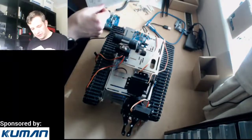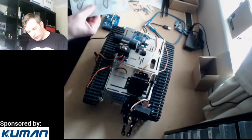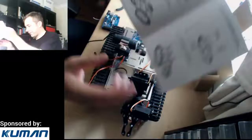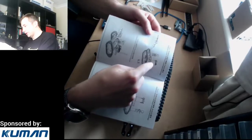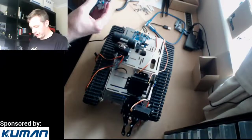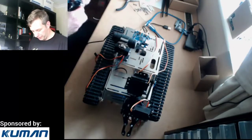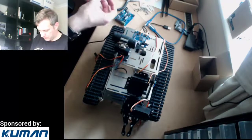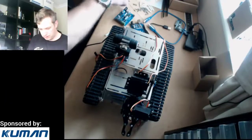So we have this, we've done this. That shows you on the car, that's no use. Okay, that shows you on... Alright, so that goes underneath it, the module, as you can see here. The Wi-Fi module goes underneath it, and the Arduino goes on top here. So that's what we're gonna do. Let's try to find the correct alignment. So we need these standoffs, like this, and to secure them we need to remove the hat. And because that's going to be ridiculous, I'm just going to swap it with these ones, because they're shorter here.